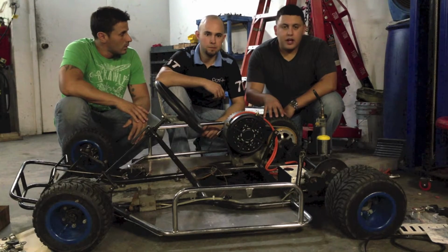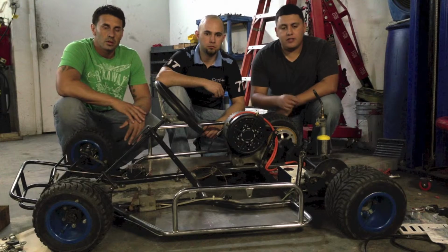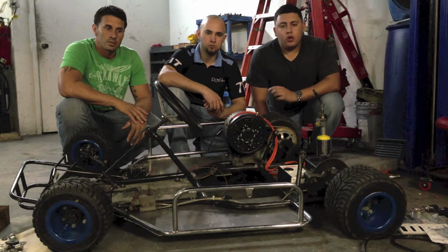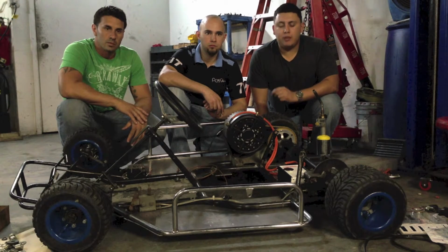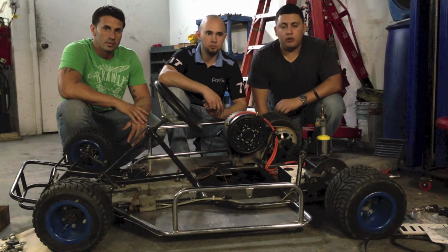I was also in charge of redesigning our traction control system because the Hall effect sensors that we used were having issues with the voltage input and output to the Arduino. We thus changed to modified infrared sensors, with an emitter and a detector with a reflective plate on the inside of the wheels, to be able to read a more consistent voltage.